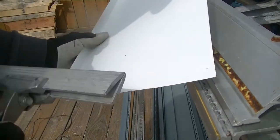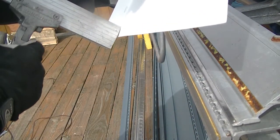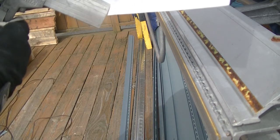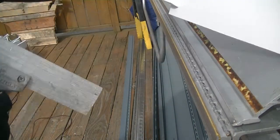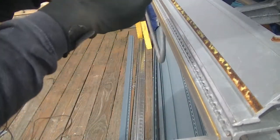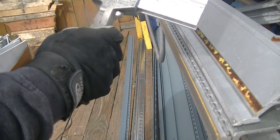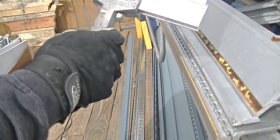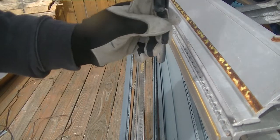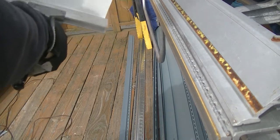Now, just like the big brake, I'm going to grab this inside. I cut with the tin snips just 3/4 of an inch. So I'm going to make a really nice tight corner, grab this, bend it up. Okay. Now I'm going to overshoot this bend just so I can get at this piece of metal. I'm going to bend that up a little bit. I'm going to grab right at that 3/4 inch mark, 3/4 inch mark. Now you can lock this one down like I locked the big one down. It doesn't have a big bar, but it has a backside that I can lock in and bend with my hand.